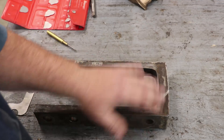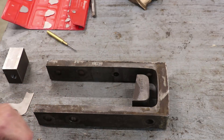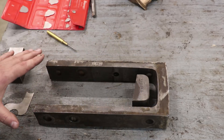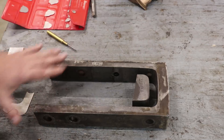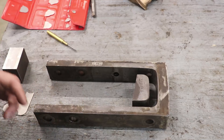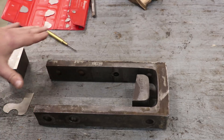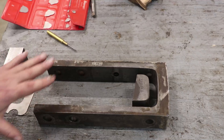Basically we're just compensating for the wear — or the deflection — in this part. I could make a new part, I could try to straighten this, but we discussed that and basically said no, we're going to leave this piece alone. Even though we've got this little deflection in the back, it fits the locomotive perfectly. We've got two pins here that are actually tapered bolts that snug everything together, and the bearing slides in there — all of that is perfect. The fear is that if we go in and try to deform or reform this back to its original shape, we're going to mess up the geometry somewhere else. While it's not ideal, it's probably best to leave well enough alone and work with what we've got.